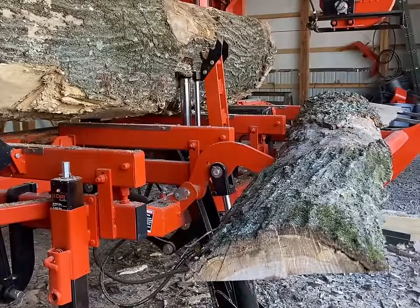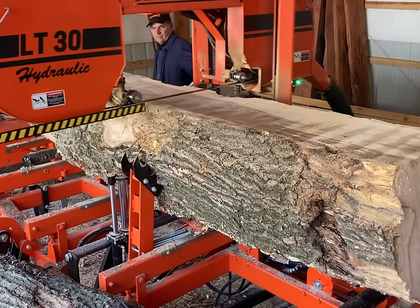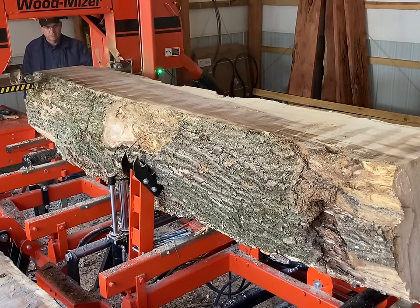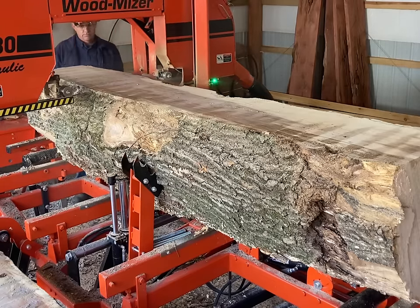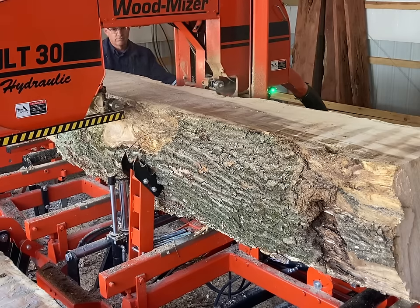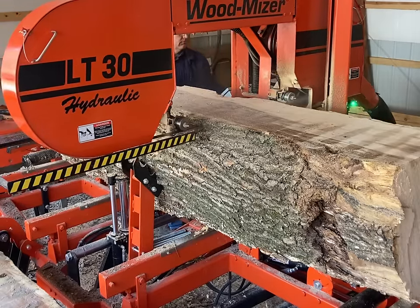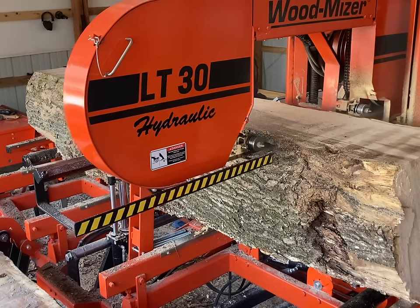The slab I'm cutting off right now looks pretty thick, but if you look at the log after I've cut it, there's almost continuous sapwood on the butt end. So we've got spots with lots of sapwood, we've got this large knot on the side — which is kind of unusual for a butt log, especially on something this big unless it's a yard tree — and then we've got the stress crack, which is pretty significant. We've also got the blue staining, and they're all oriented about 90 degrees apart from each other. So to say here's the best opening face — there really is no best opening face on this log.